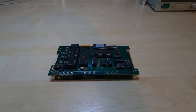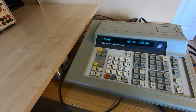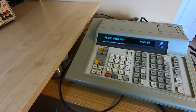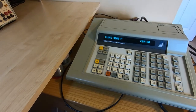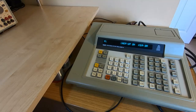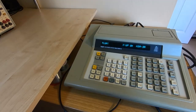Anyone that's been repairing this sort of equipment for any length of time may well have picked up one of these. This is a Fluke 9010A. It's essentially a piece of test equipment that allows you to test boards on a single-step processor basis — you can run specific tests, test memory locations, you can do quite a bit with it. But one of the issues is that the pods required to interface it to a given processor board are becoming increasingly rare to get hold of, and hence very expensive.